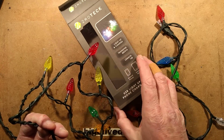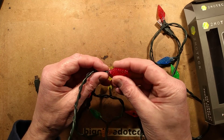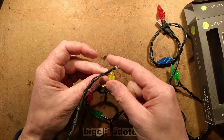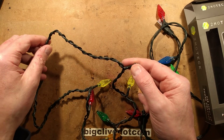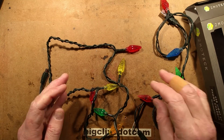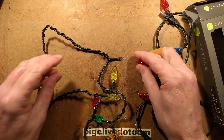However, I bought a set of these, plugged it in, and noticed that the first LED dimmed quite quickly. I've used a heat gun to move the hot melt glue off this end for closer access. Traditionally there'd either be a resistor in here or in the plug, but I'm not sure there's one in either. Because these LEDs, instead of drawing about 20 milliamps like the original set, actually draw about half an amp. And the LEDs are very, very bright, and then the first one in the set starts dimming.